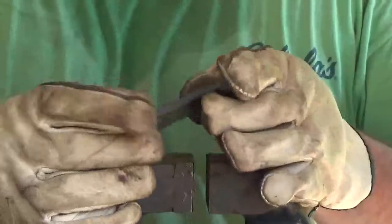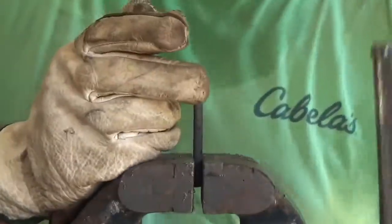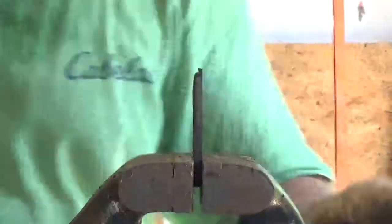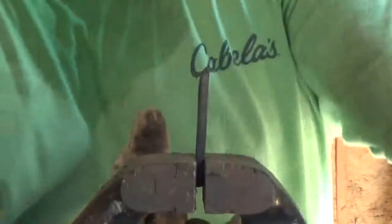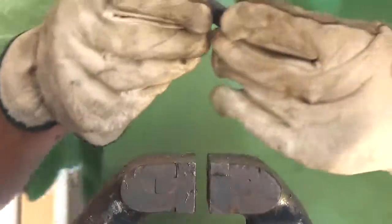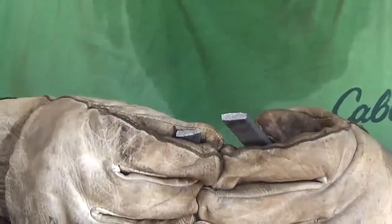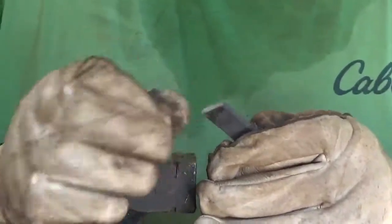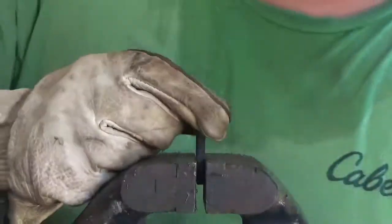Here's the normalized, hardened, and tempered one — one hour at 400 degrees. I think it broke. It broke. It took a lot more force to break it. We'll get a close-up of the grain here in a second. I'm going to hit this piece again.